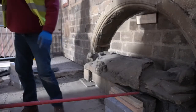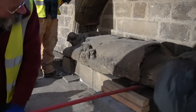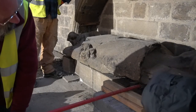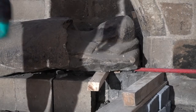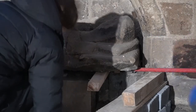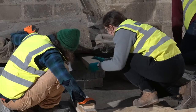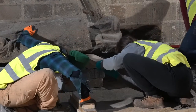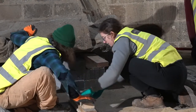Even though we think of stone as being very hard, it's actually quite soft compared to steel. So we didn't want the crowbar to scratch him in any way, and we were also thinking about point loading and spreading the stress. Lead, being quite soft, will negate the risk of scratching and will spread the load a little bit from where we are lifting him up.